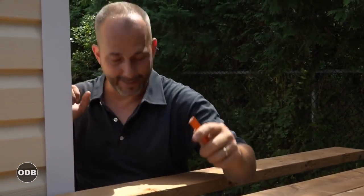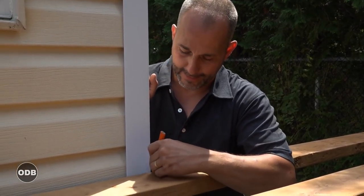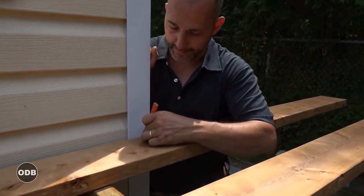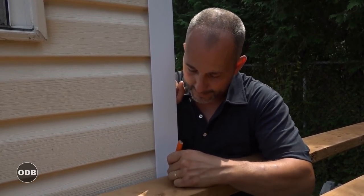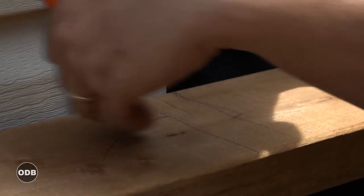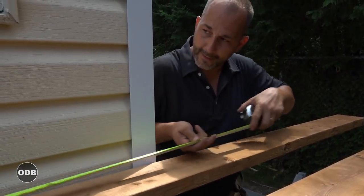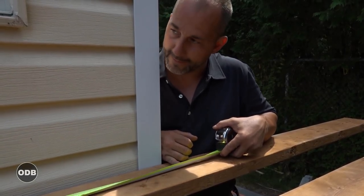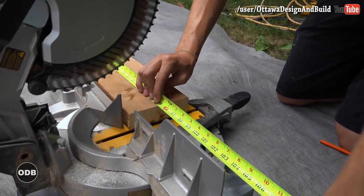Now we're going to measure for the rest of our deck. We're going to have the finished part of our deck finishing off the corner of the house. I like to have all of my decks with a picture frame outside — kind of like a nosing on a stair — so I'm going to run back about another half inch for nosing. And because I have a ramp, I also want to have a skirt board, so there's another half inch for that — a little bit more for good measure. I'm using the side of the building to determine my design instead of letting my design cause me all kinds of problems. That works out to 95 and a quarter inches — 95 and a quarter, 116.